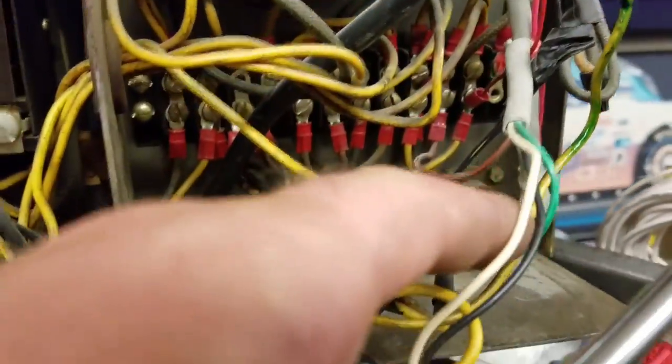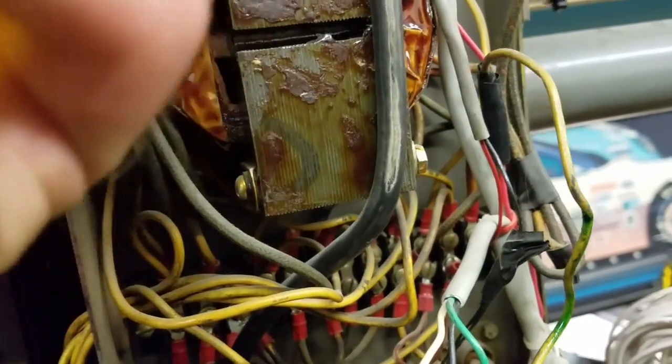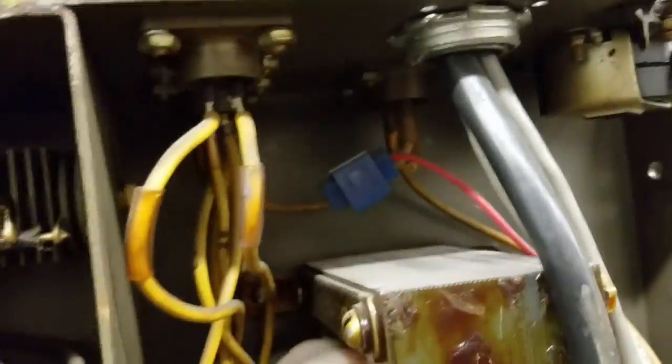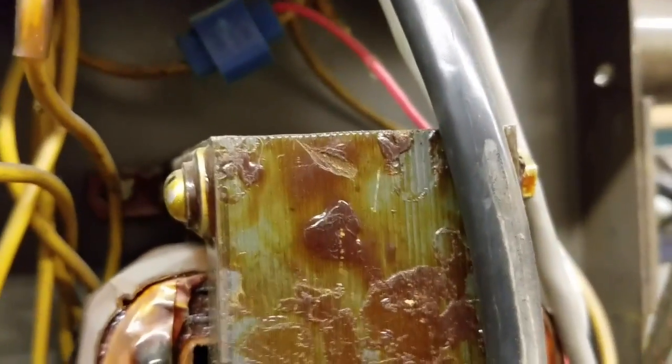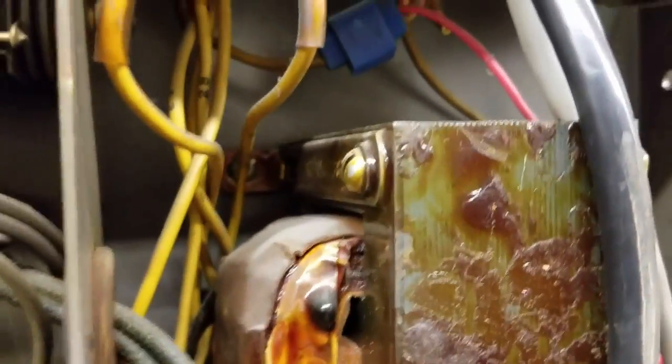The green wire is connected right. The brown wire is hooked up. TS2 10 is right, and the red wire is tied into BB from my CP3 to CP5, which is right. This wire, actually, come to find out, this wire being cut off right here, that wire, I don't need to do nothing to that. I'm guessing it powers the ball booster, ball accelerators, which we don't have, which would explain why that wire is cut off. So it doesn't cause any issues, and we don't need it for anything, so no need to hook it back up.